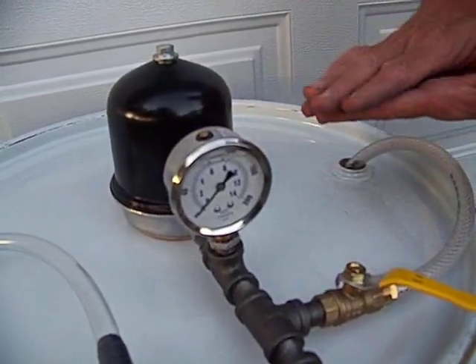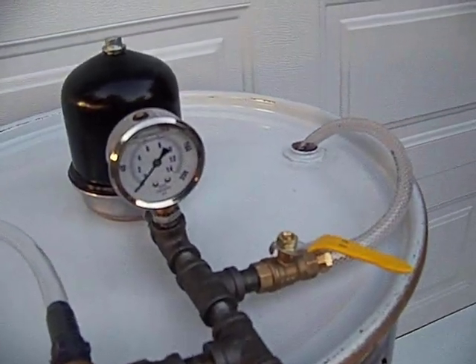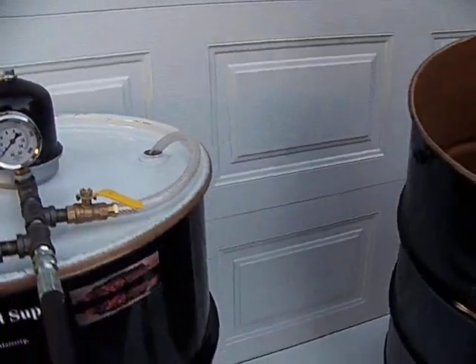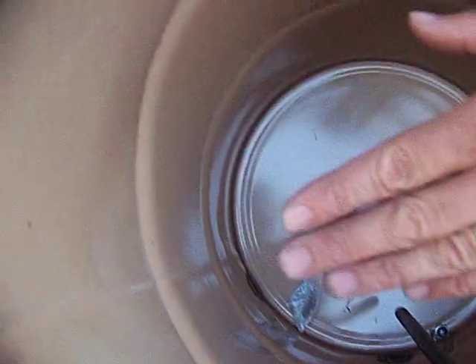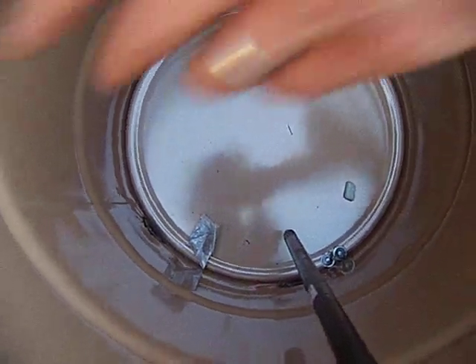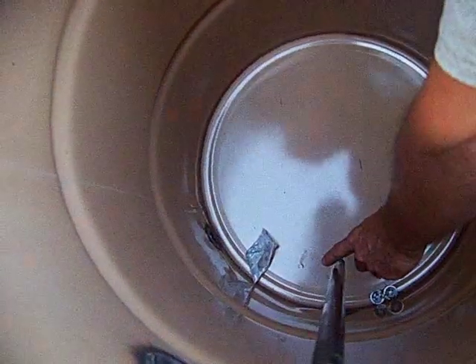The hot oil is coming up, the cooler oil — and again, it would start to drop. So what I do is, in this drum here, I would hook my bypass into this. Notice it drops it right down on top of the supply tube. So the only thing that's dropping in would be the clean oil. Of course, there's a bunch of crap in my drum too. This would be where the centrifuge mounts on this one — it's dropping the clean oil in. The bypass is hooked up right here, bypassing the oil down — figuring this is all filled. So all your dirty oil is being sent to the bottom of the drum again. I like that one.